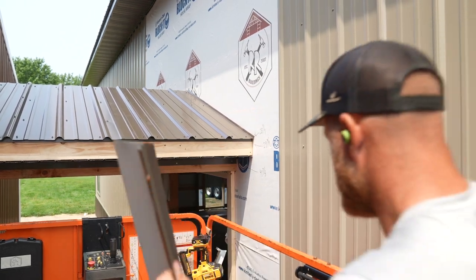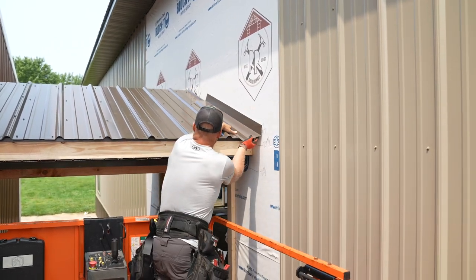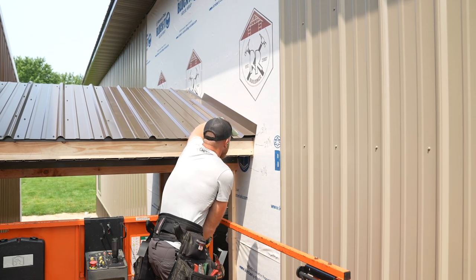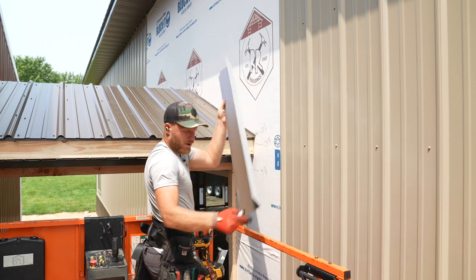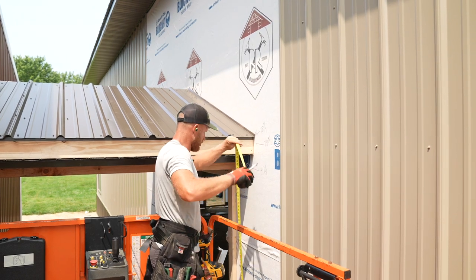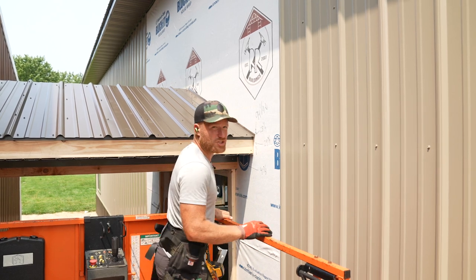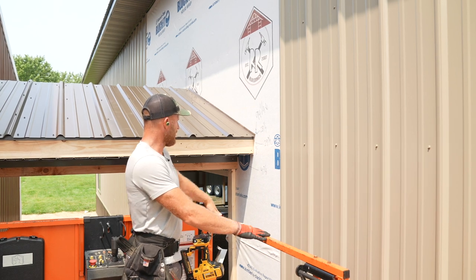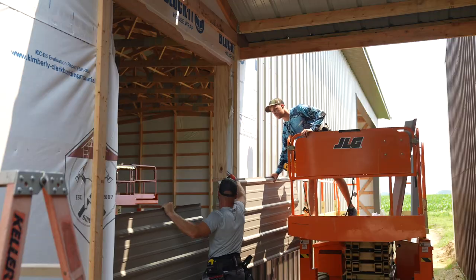87 1/4. What I'm gonna do is take a piece of this sidewall just as a guide, and it's gonna go somewhere just like that. And I want to make sure my cut is about that high. So I don't want to be tight on this trim. I want to go up at about 1/4 of an inch. So that's a 4/12 pitch. I know that. All right, I think I'm ready to mark this sheet all out. It's very important to spend the time here making sure that all your measurements are correct, because you only want to do this once.